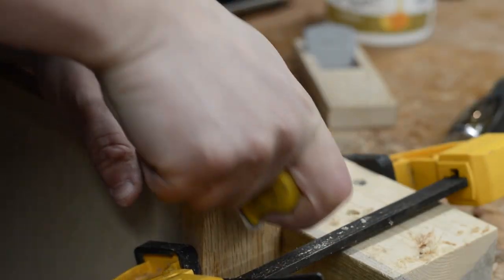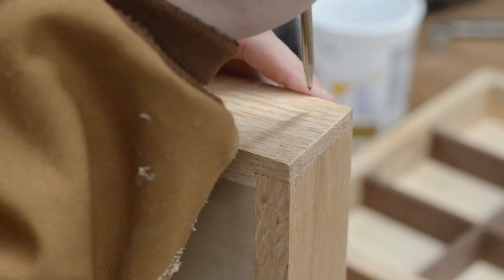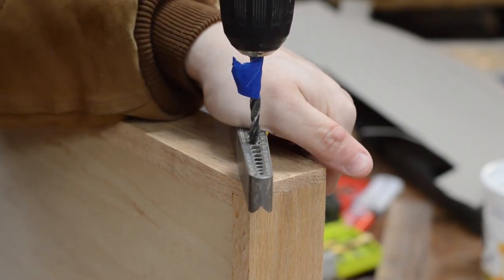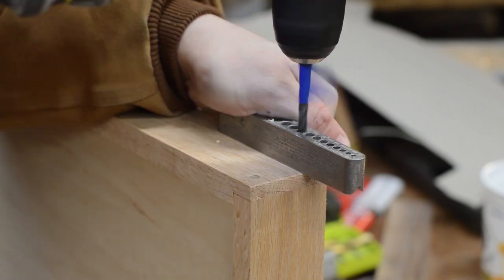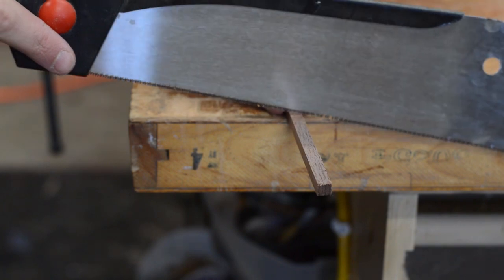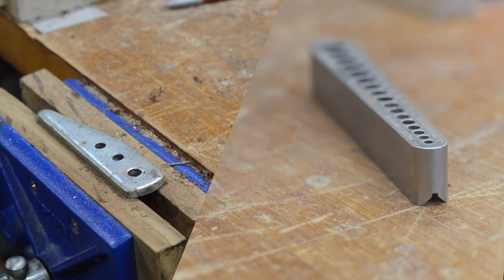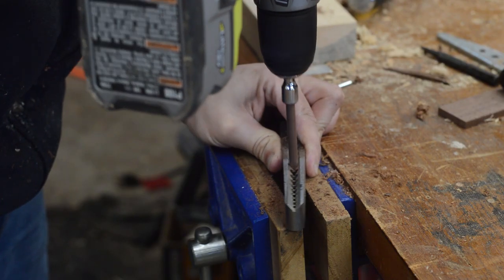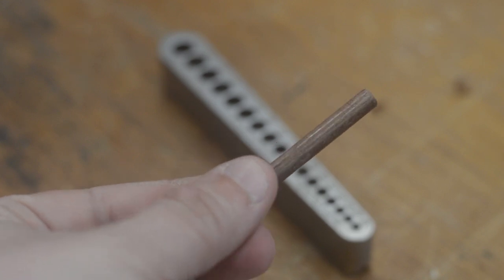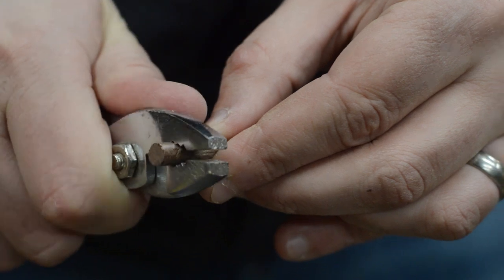I used a chisel and some sandpaper to soften the edges. I wanted to reinforce the edges with dowels, and a test piece really helped me dial in the distance from the corners. Once I had the dimensions down, I marked the locations of the dowels and used an awl to help get the drill started. I used blue painter's tape to mark the depth on the bit. I don't have a dowel plate, so I tried making dowels from walnut by starting with roughly quarter-inch square stock and pounding and drilling it through a scrap of metal—and also that drilling guide. The hole drilled in the scrap metal worked just fine, and I used a file to put little notches in the hole to help with the cutting. After the dowels were made, I used a jig to cut them to length with a pull saw. To make sure the glue would have room to escape, I crimped the dowels with pliers before gluing them in place.